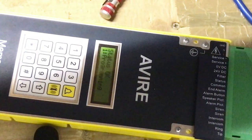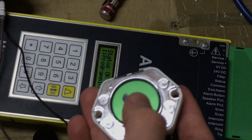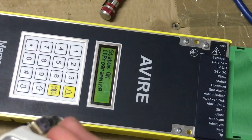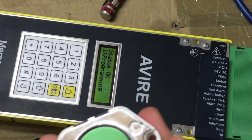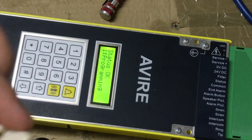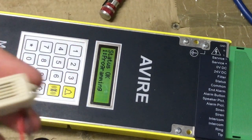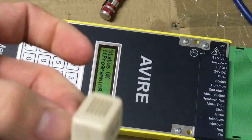Now I think the best thing is to watch it dial out. We'll press the lift alarm button, which will make the buzzer go. But it glitches out because there's no number programmed — the LED instantly went out. What you need to do before testing is go in and put even a dummy number like '1', exit the menu, and try again. But wait — the buzzer is trying to go, and I think I chose a dodgy buzzer. I can feel it trying to buzz but it seems it's gone dead, so I'm going to stop the video for a second and wire something else up.